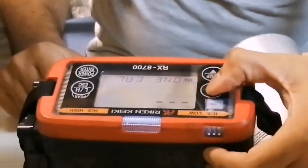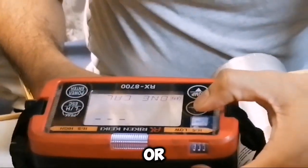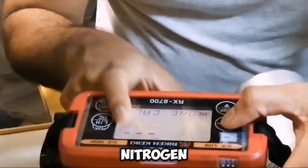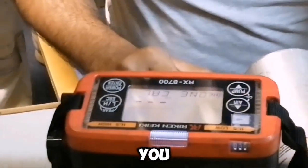This meter is very simple — calibration mode is written on it. You press both these buttons and it goes directly to one cal. Same as before: one cal is the same in both meters. You have to do percentage LEL, then percentage volume, then O2 — O2 is always done by nitrogen gas. H2S you can use the dedicated bottle.